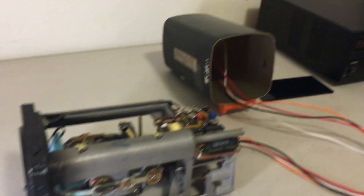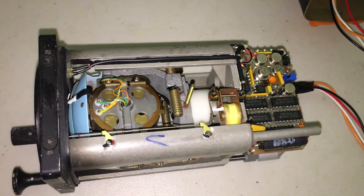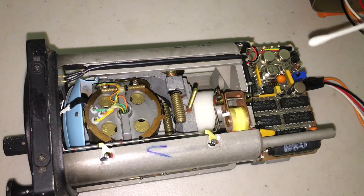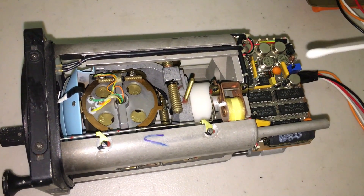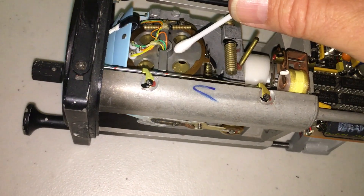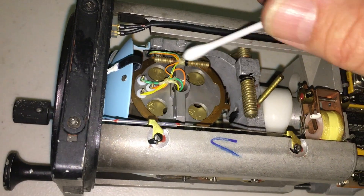In the follow-up videos we'll be operating the unit and testing it outside the case so we can see how the mechanism will actually self-correct the gyro. Being an electrically operated attitude indicator, the first thing we can see here is a printed circuit board with a number of electronic components, and as we move forward we can identify the gyroscope itself, which is just inside this housing — that brass colored metal object inside.